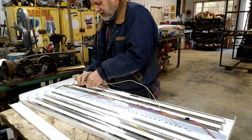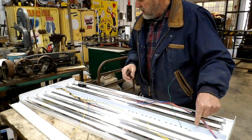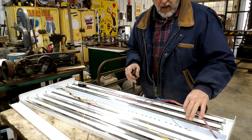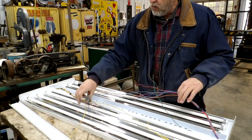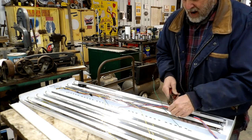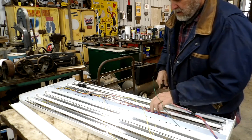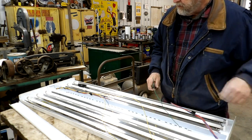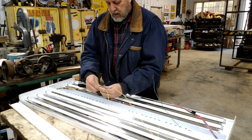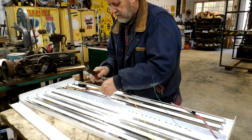I like things to be orderly. Now, this is the hole where the wires came in from the ceiling — there's a black wire, a white wire, and a ground wire. The ground wire hooks to the green. The black is going to hook to one of these and the white is going to hook to the other one. We don't need it this long, so I'm going to cut it off about right there, and I want to cut them all the same length. This one is coming from the other end, and we're going to have to run another wire down to here where it's going to tie in with our electric. So we've got to cut all of these the same length as well.